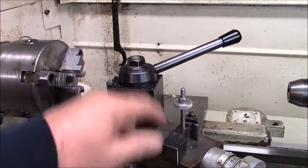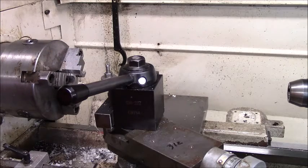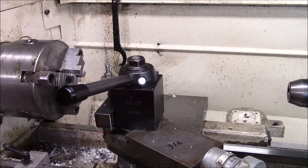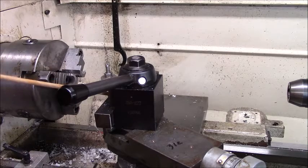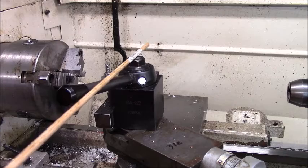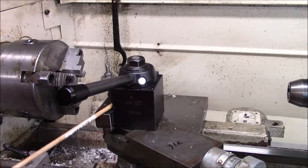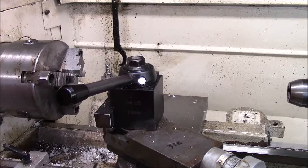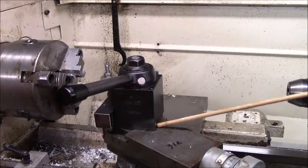So, here's my point. This tool's geometry is designed to work at 90 degrees from the spindle to work properly. It isn't designed to turn this block 10-15 degrees to change the top cutting angle. A lot of the reason people do that is they're trying to change the cutting angle for chip control. Chip control is on top of the insert, how the insert's designed. It doesn't help that much. So why do I need a handle up here to move this thing around when I don't move it? The only time I move this is when I cut a taper, then I re-square it, and I still try to work at 90 degrees. Or I may adjust it when I'm double-checking my cutoff tools. I hardly have to move my cutoff tools and realign them, because once this block's set, I don't mess with it.